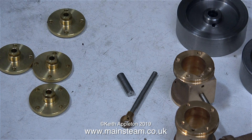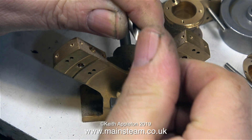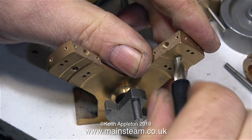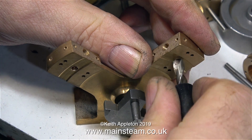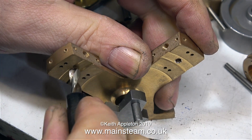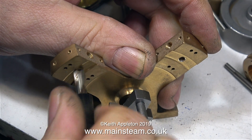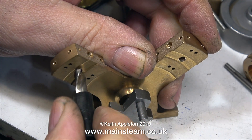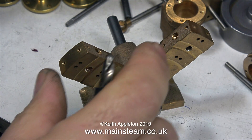Here are some parts that have escaped from the box — these are the parts I'm going to be using very shortly. The first thing to do is a slight amount of deburring. What I normally do is put a piece of silicone rubber tubing around a drill bit; it makes it much easier to handle and lowers the risk of personal injury if the drill bit suddenly stops. You'd probably only notice it when blood appeared on the bench.